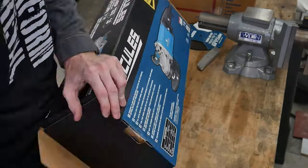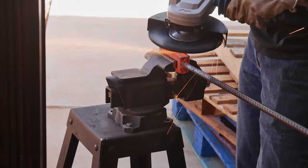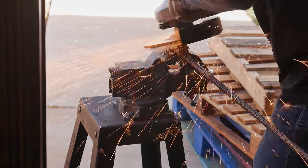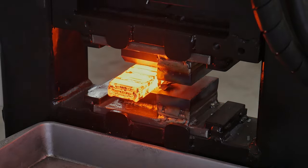I used a 7-inch angle grinder from Harbor Freight to grind off my MIG welds after I knew the stack was nice and solid. I've skipped this step in later builds without issue, but it really depends on the pattern you're trying to go for. I feel like this is a conservative option, and I can't afford to waste time in the shop with mistakes.